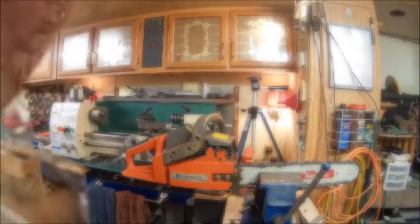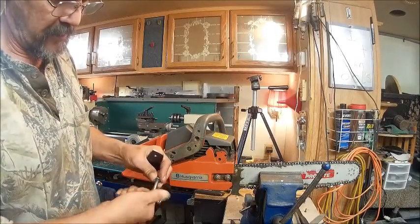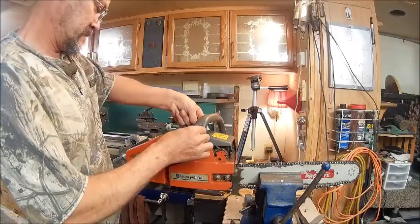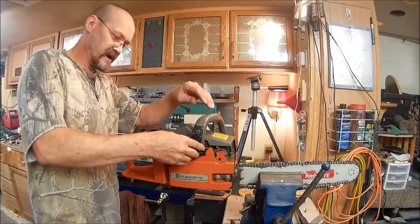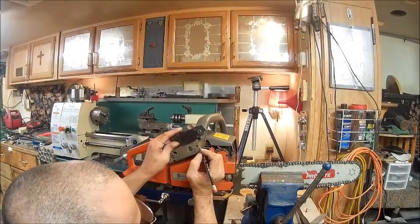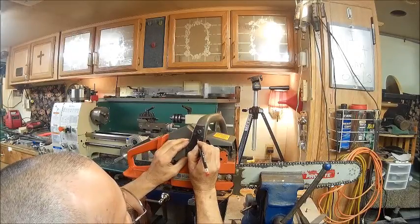We'll be right back. Now that we've got our hole drilled in this piece, we've got a quarter-inch bolt with a flat head screw on it that we're going to stick in there and that'll hold it for us. Now this ain't going to be to my liking, but without somebody spending a little bit of money to make it right, there ain't a whole lot I can do about it. So now we know where this hole is right here that used to be there. We're going to bring this out, put that in location, and then draw a mark right there.